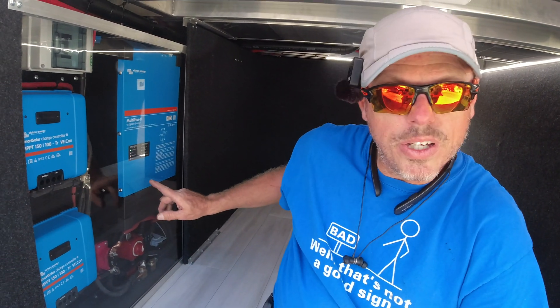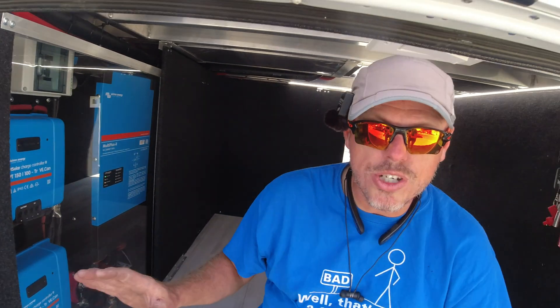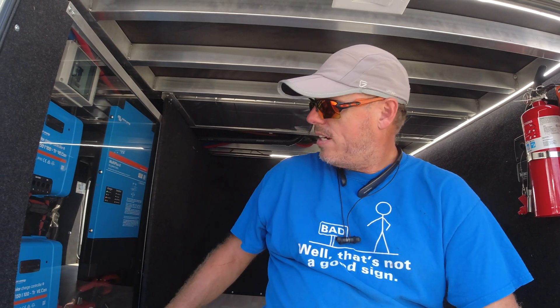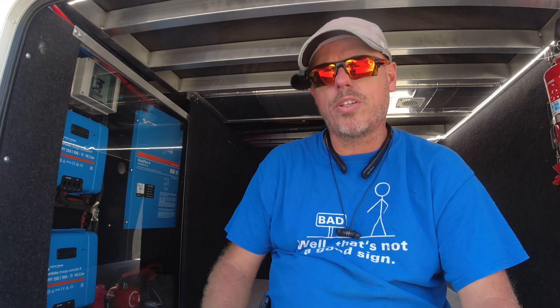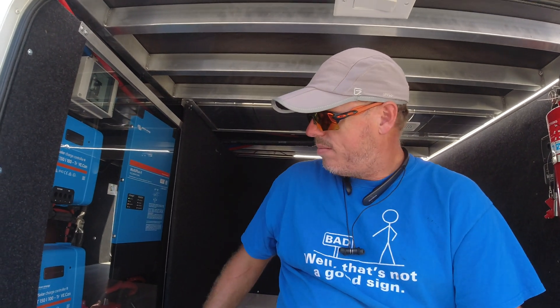Just a little quirky thing that I came across. Other than that, it's been really smooth, really easy to do. The connections inside it are kind of a push-in instead of a screw terminal, which was a little different, especially working with 6-3 wire. It actually was pretty darn difficult to get it all up under there and to get it to stay. I don't really like those connectors — I would prefer something under a screw terminal that you can tighten down and have a certain torque load on it. But other than that, I actually really did like the Multi-2. It's definitely a thumbs up for me for a single inverter 50 amp upfit.